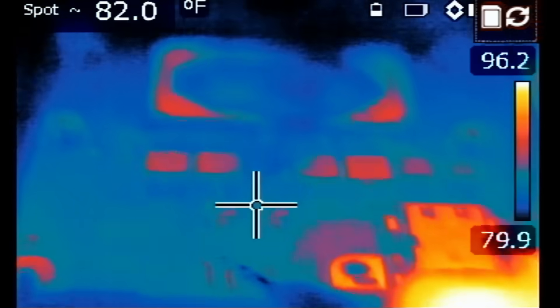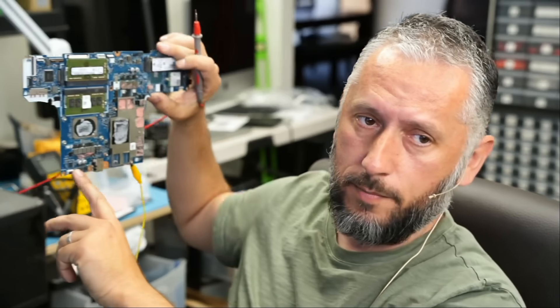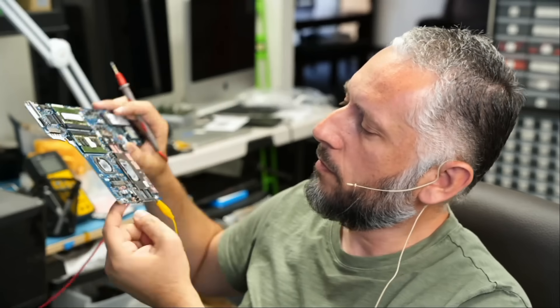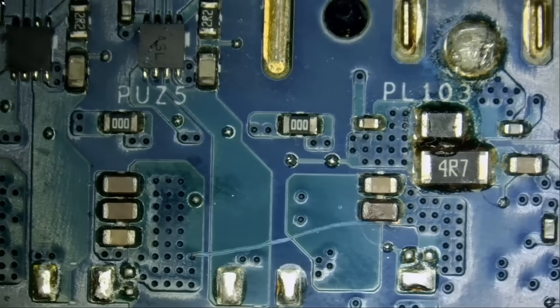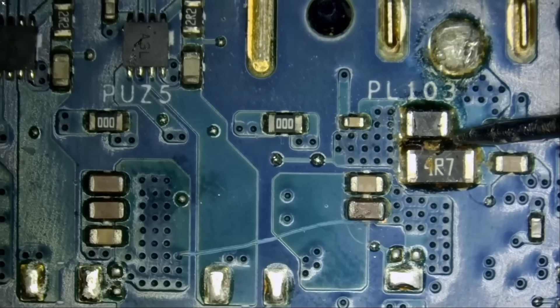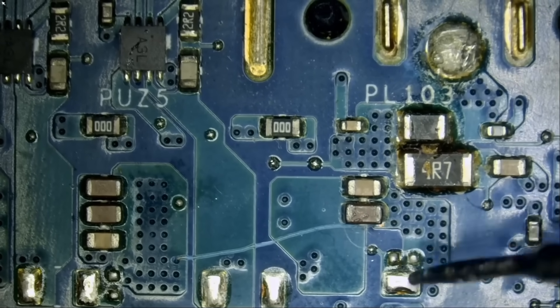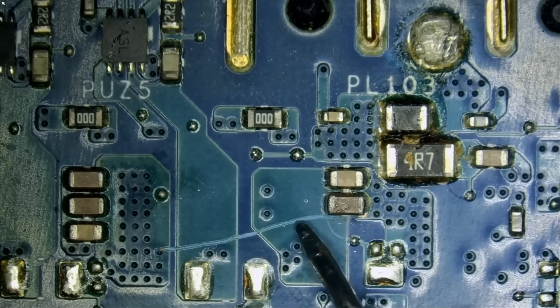The heat is not coming from this side of the board, so we're going to flip it. Same area — I'll point my finger at the board. Heat is coming from here, and I'm interested in the same area on the back. Let's look under the microscope. Nothing too obvious but a few things ring a bell. We have a lot of burnt flux here from excessive heat — that's factory flux — because of a short circuit in this area. You can tell I was probing around before I started the video, but I did not discover where the short is coming from yet.